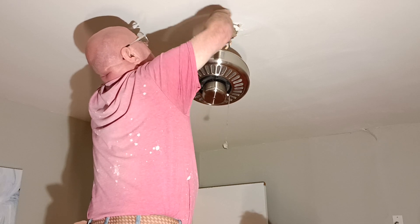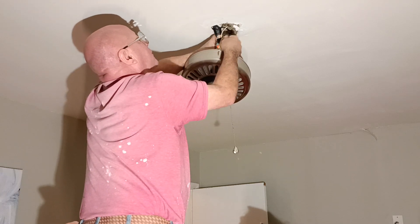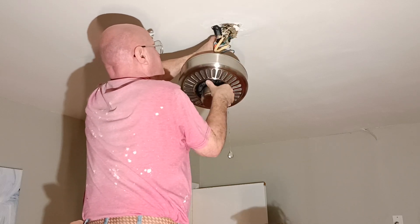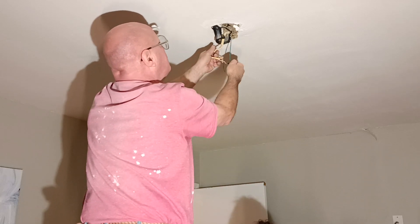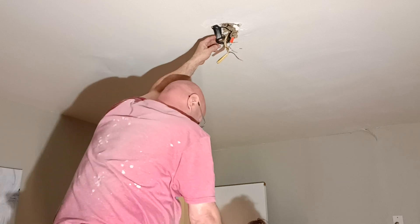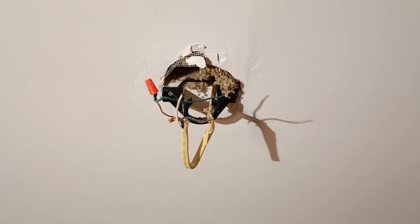We do have to go get a box because this is hooked up without a box. And Harriet, you've got to do some grinding. I don't have light bulbs, so that actually works in our favor. All right, there's those screws. Why do we need a box if it's like that? Because the splice is embedded in the ceiling and there's paper — it's flammable, combustible material. And this is not up to code the way that is. You need to come down because that chair is going to fall. Down I come. So that is not up to code. We're going to go get a box. I'm going to put this up according to the NEC.